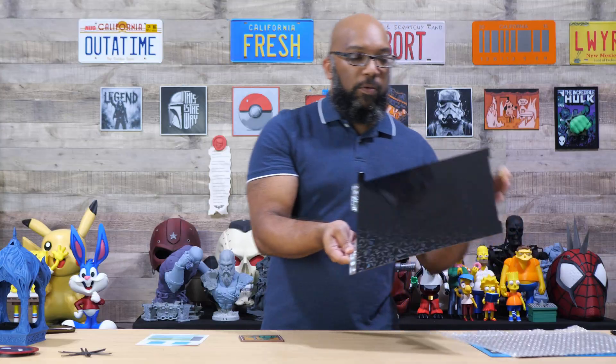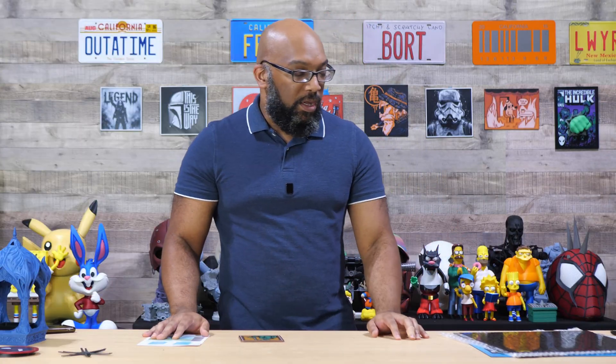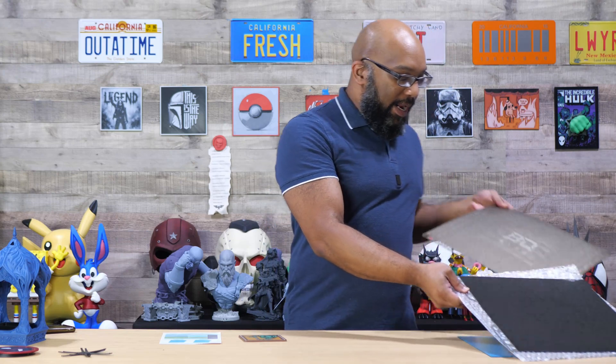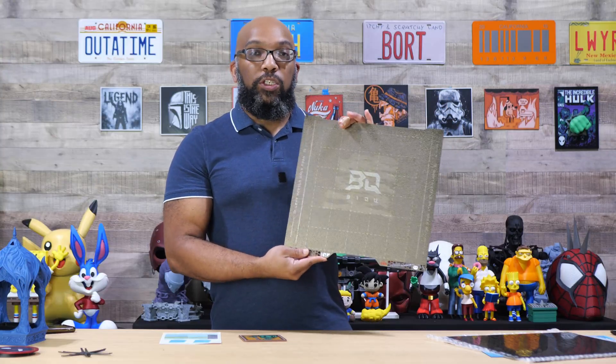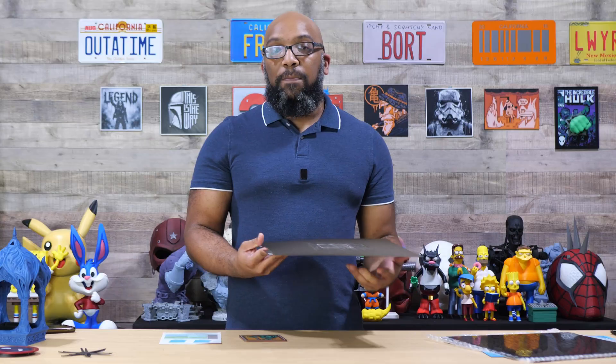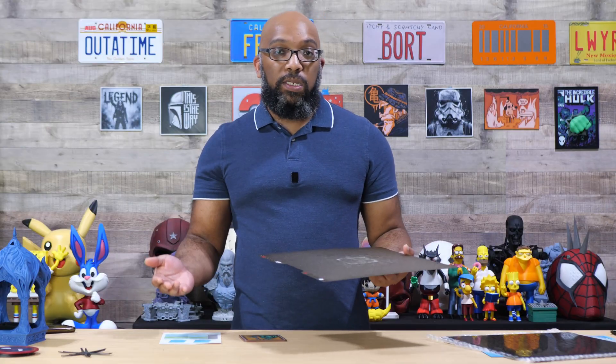So I think the PyroGrip plate is a little bit of a harder sell, but the CryoGrip plates — yes, those are good. As for the fancy pattern plate, if you've got some patience you can definitely work with it. I'd recommend a clear glue stick or some type of spray adhesive to make it more reliable, but it's really more for decorative purposes anyway. One more good thing to note about the PyroGrip plate: it actually has markings that the H2D will recognize, so it won't give you those same errors about the build plate marker not being found that you get with the Frostbite plate. These markings are actually useful — you don't have to worry about clearing an error when you start a print.